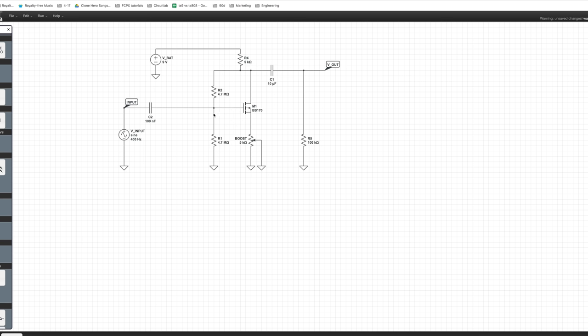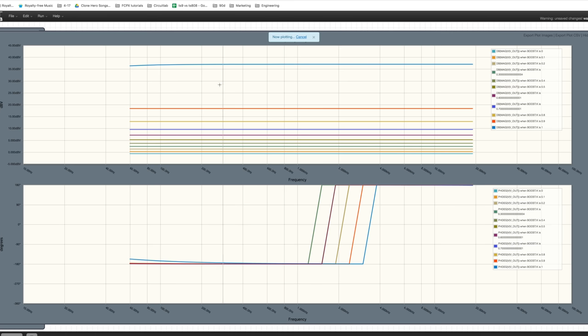Let's look at the circuit in more depth. Here's the MOSFET circuit — it's pretty simple. Sound comes in through here, hits this MOSFET, and all this stuff does the power amplification. The sound goes out through there. Can't get much more simple than that. When we simulate it sweeping the pot, it's pretty neutral still — dropping a smidge of bass, but not much.